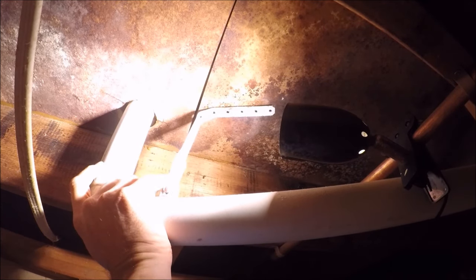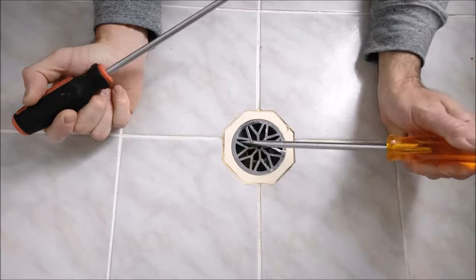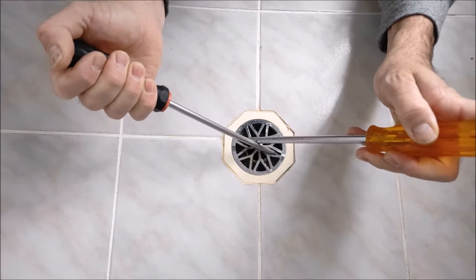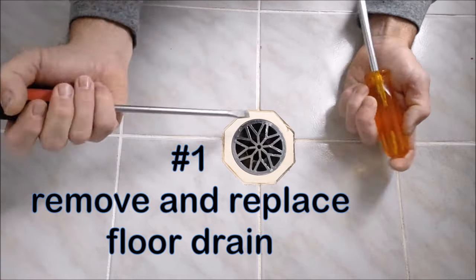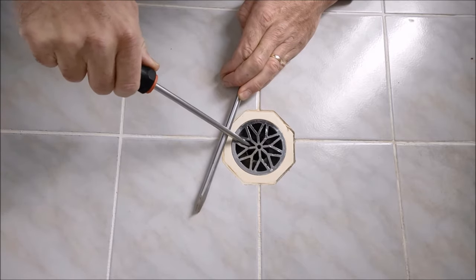Undo any brackets and dislodge the waste plumbing pipe from the shower waste. There are two common places that water leaks from: the first is the drain and the second is the shower's membrane. We stopped using the shower upstairs to let the timber and particle board flooring dry out, but this doesn't fix the problem. I'm going to start today by removing the drain grate and drain and having a closer look inside.